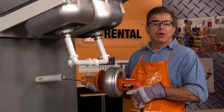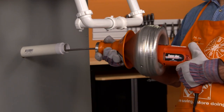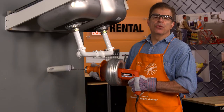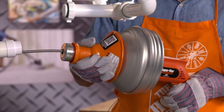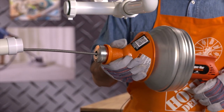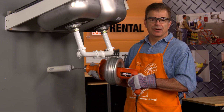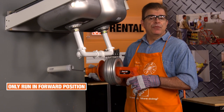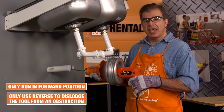Do not force the cable. If the cable begins to buckle or twist, immediately stop the tool. Then slide the grip shield forward and push any excess cable back into the drum before continuing. Go slow and don't force the cable. When you meet resistance in the line, move the tool back and forth until the resistance lessens and the cable moves freely again. Keep repeating the same procedure, slowly working the cable into the drain a few inches at a time until the line is clear. Always keep the Super V trigger switch in the forward position, whether you're feeding cable into the drain or pulling it out. Use reverse only to release the cable if it gets stuck.